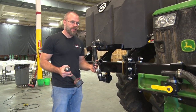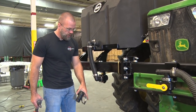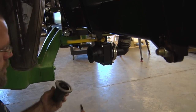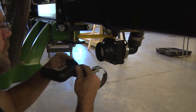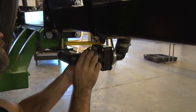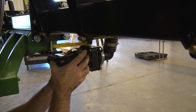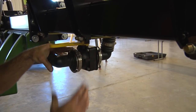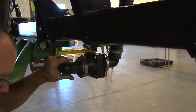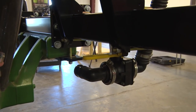Okay, we're gonna start plumbing the right-hand tank with the lines group optional. What we're gonna do is put the elbow on the back of the 2-inch valve here, and then route the hose from that barb up to the front T barb here. All right, we're putting the 90-degree elbow on there with the seal in between this clamp. Just point it straight to the left here, will be ideal. Turn that down. Okay. Get a little lubricant here to put the hose over the barb.